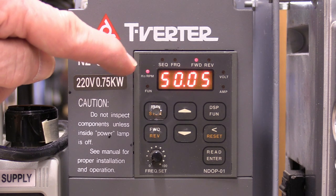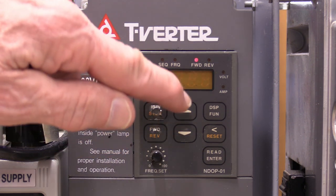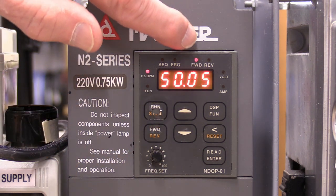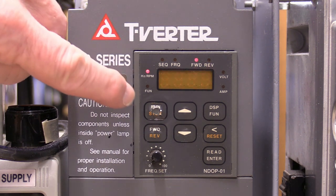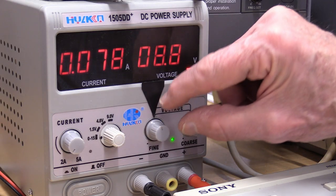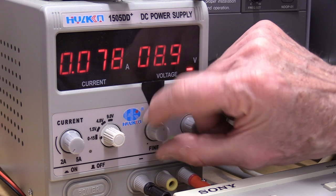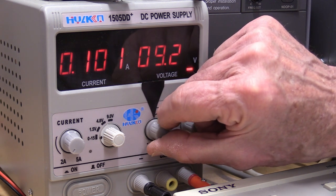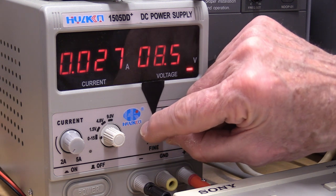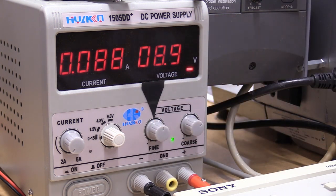First thing I've got to do is check that the frequency is at 50.05 — and that's correct. If it's not, you've got an adjustment here to take it to 50.05. Also check that it's actually on forward, which is important so that when you actually press the run button, the projector's going to run forward. This knob here is controlling the voltage of the projector lamp. If the film is looking too dark, you can wind the voltage up to make it a little brighter. If it's looking too bright, you can wind it back to reduce the voltage to allow the film to be at its optimum level.